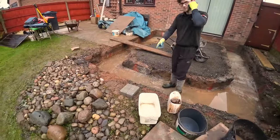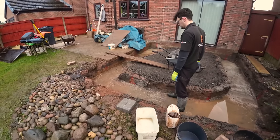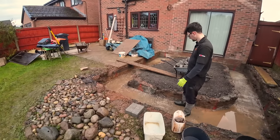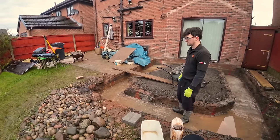Where are the commons for? It's trench, 4-inch and a common. Okay. Well, I dropped it, of course. It's usually a trench and a block, isn't it? Right, okay. So it's the trench and then it's 300 to damp. So it'd be 4 face on the outside, a block and a concrete common on the inside.